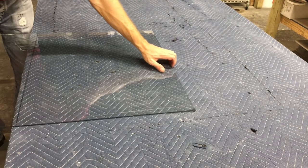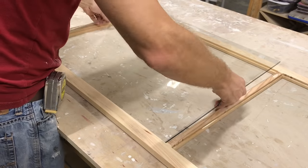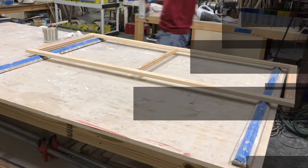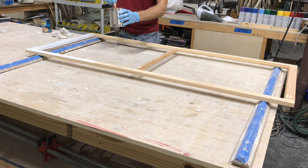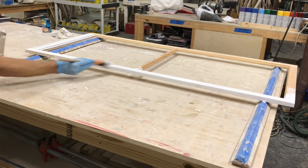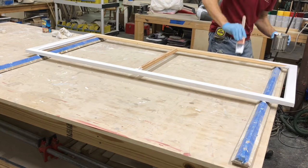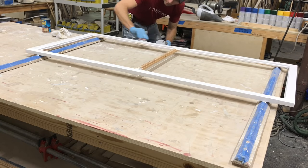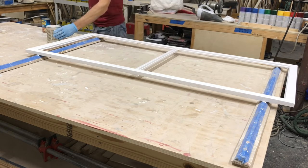Pop goes the line, snap it on the edge, and we're ready for the top piece. If everything fits like it should, it's time to prime your window. I recommend an oil-based primer — it's a lot better than latex. It sinks into the wood better and helps seal it better. You want to coat all sides of your storm window with the oil-based primer, and do this before you set your glass in glazing putty. Cover everything in the rabbets, on the face, everywhere — if there's wood showing, it needs to be primed.